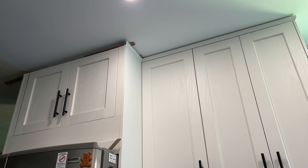We're almost complete installing the deco strip on this section of cabinets. One tip: where you have an area like this over the fridge, I like to install both end pieces first, then you just take one simple measurement in between, and it completes the cut no problem.